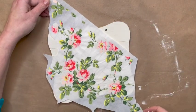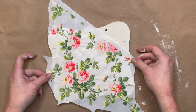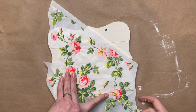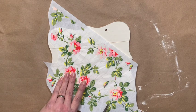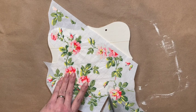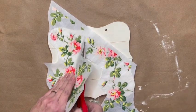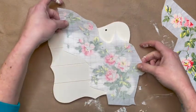As you can see here, I have the inlay actually the wrong way because this is the paint side up. You want to plan it out with the paint side down because that's how it's going to apply to your project. So in a little bit, you will see that I realize I have it upside down and I flip it over. Lucky for me, my little bit of planning and cutting here isn't a disaster. And here I realized that it was upside down.